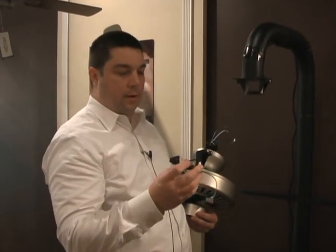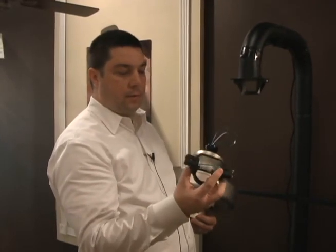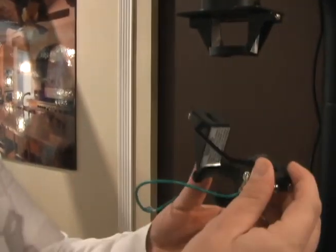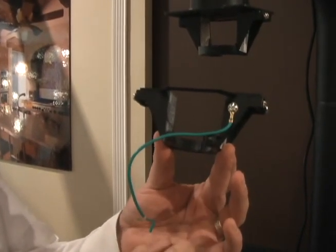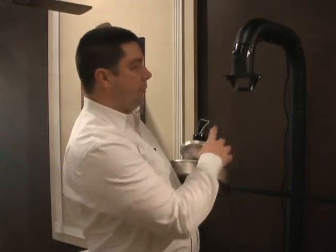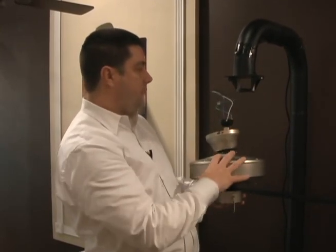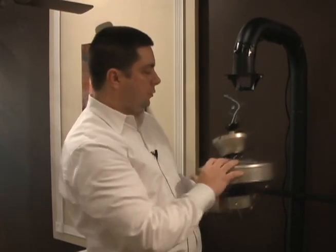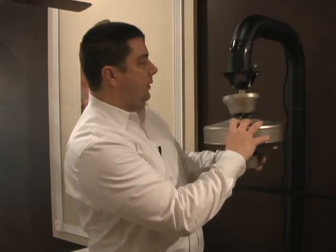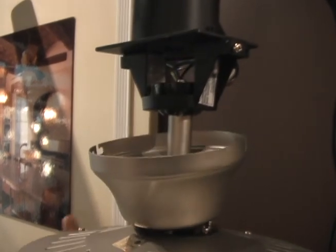The next step is finally mounting your fan to the ceiling. Using your ceiling bracket, make sure that the rubber pads are in place. They need to go between the bracket and the mounting surface — this will cut down on humming, wobble, or any other kinds of noises. Once you have the bracket in place, you take your assembled down rod, fan, and motor and set it into place. Each one of these fans has a notch in the ball so it'll lock itself into place. Once you get it set in place, you turn it and it'll fall into place, which keeps the fan from torquing.